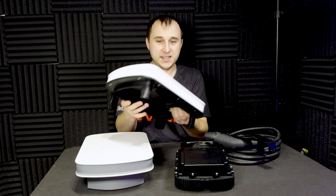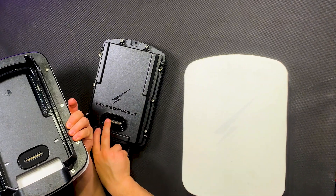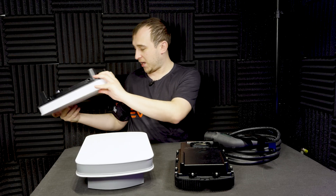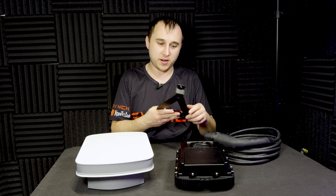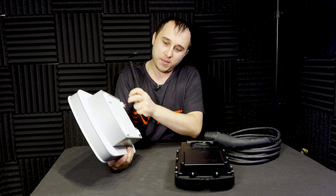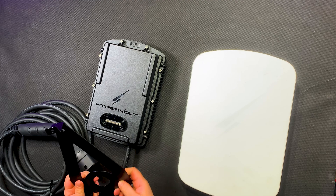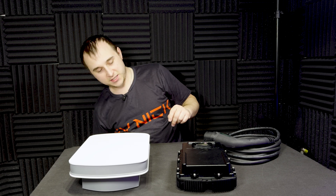Straight away we can see the LEDs built in here and around this cover, connected by pressure switches on this front cover — that goes in there and lights up the 12-volt circuit. By the looks of it they may have got rid of the ribbon cable. You've also got this bracket which holds the charger at the back, rather than screwing through the back or having hooks like the old one. This is copying most of Hypervolt's competitors, making it easier for an engineer to drill the template on and click the charger in.